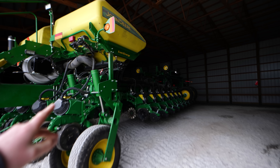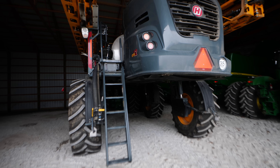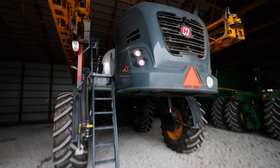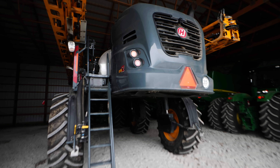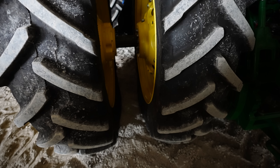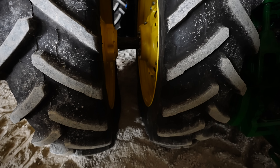I'm going to look at this planter some more — it's pretty close to ready to go. I'm also taking inventory on both the Haggie and the tanker trailer to get new sight tubes in and replace anything I think needs replaced before we move into the next spray season. I've got to put in a pretty big and pricey order to get those things in and installed with time to spare, because we'll only blink our eyes a few times and the planters will be rolling. I may also back this planter out and make some adjustments to the tire pressure over at the big air compressor. A lot of people were saying around 15 to 20 PSI for this based on the planter it's pulling. I'm going to at least check first and see how much PSI is in the tires — they look a little low.